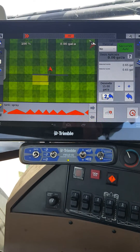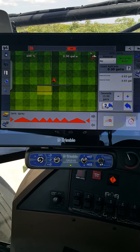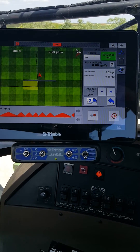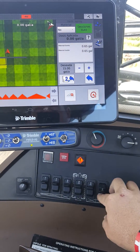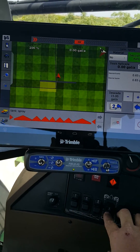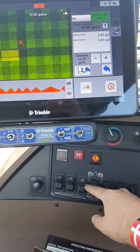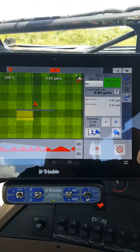If you wanted to be more in control of where you can spray — say you wanted to go spray a fence row or a ditch, just going around spraying ditches — and you want to open up a field and spray with just part of the boom, you would reach down and cut off the sections you don't want to spray with. In this case, we're spraying with just these three sections, so you would only turn on the ones you want to use.